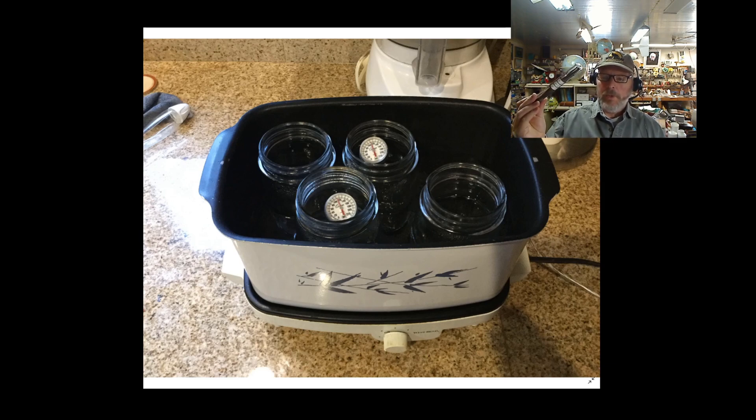If that's the challenge you face, I'd probably use a glass test tube — I have a 22mm one like the kind vanilla beans or cigars come in. I'd put the sensor in the bottom, make sure it contacts the side for good thermal response, then seal the opening with caulk or glue to keep water out. I'd stand it upright in the water bath rather than fully immersing it. I've never actually done this — it's theoretical — but if it works, drop me a line. I'm also curious. For calibration, I put two thermometers in the water bath and matched the target temperature to what the sensor was reading in the back; that offset value is just one line to adjust in the software.